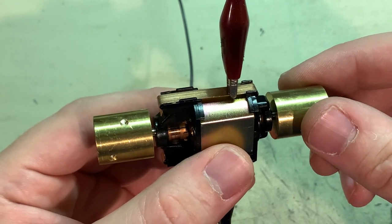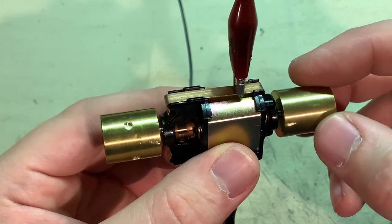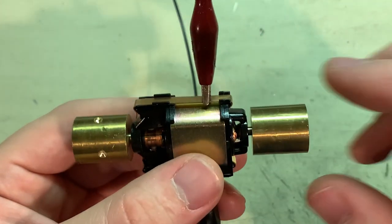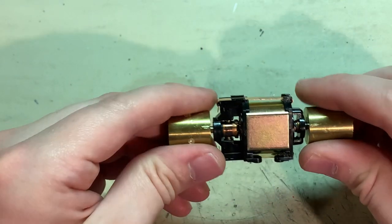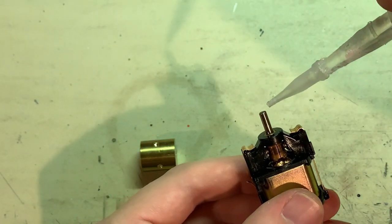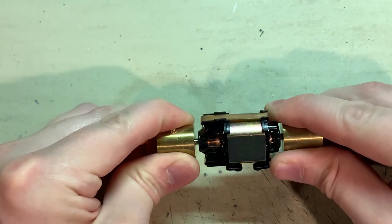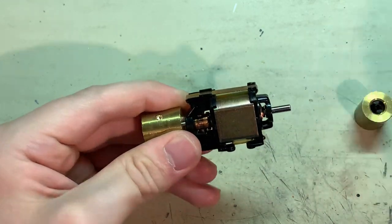One thing about balancing: if you go a little too far, just drill another hole in the other side. If you find there's a different spot, do the same thing there. Now that I've got them pretty well balanced and counter-balanced with each other, I made a little mark in each one so I can keep them aligned. Since the flywheels get a little loose from pulling them on and off, I'll put just a touch of super glue onto the shaft — only a small amount — then press the flywheel back on with a bit of twisting. Do the same for the other one and the motor is ready to go.